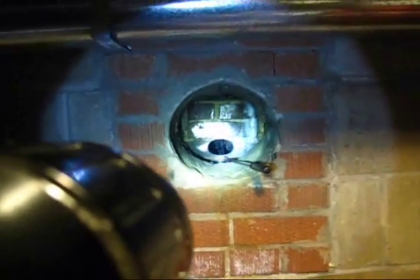I'm gonna go outside and inspect the chimney. In some chimneys there's a clean-out outside; this one does not have it. No cracks, no air gaps - the tuck pointing looks to be in good shape. Continuing up the chimney - see what I mean by a high-powered flashlight? How wonderful that is. Chimney looks fantastic all the way up.